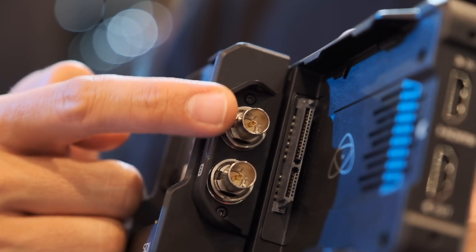What we were able to do, without making this super expensive — it's about $200 — is offer 12G SDI in and out. We were also able to offer dual link, so that's two 4K30s combined as a 4K60. We can offer output from an SDI input, but not from an HDMI input at this point, so no cross conversion yet. Right now we can't fit 4K60 SDI and HDMI at the same time. This chip is very low power but limited in IOs to keep power down.